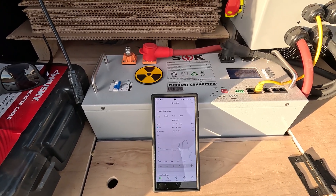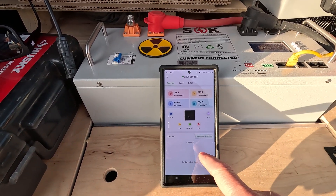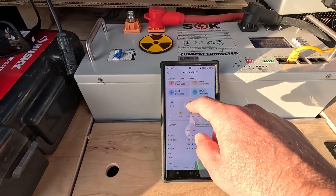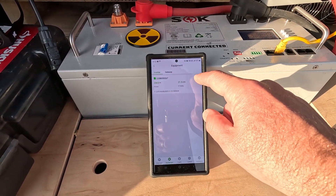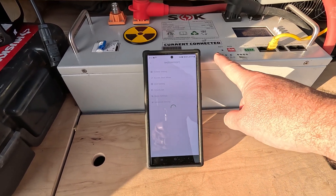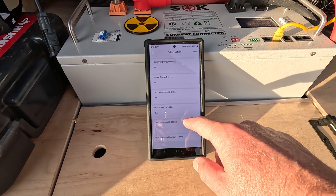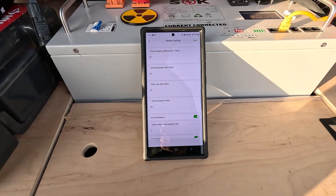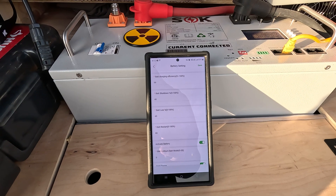It's not ideal, but it prevents me from having to come out and check on the car all the time. I can go into the equipment and change settings, get additional plots, and look at temperature and everything going on. In the setting parameters — the factory settings show 100 amps max. Battery shutdown: the system will shut down at 40% charge and restart at 80%. I can change those thresholds here if I need to.